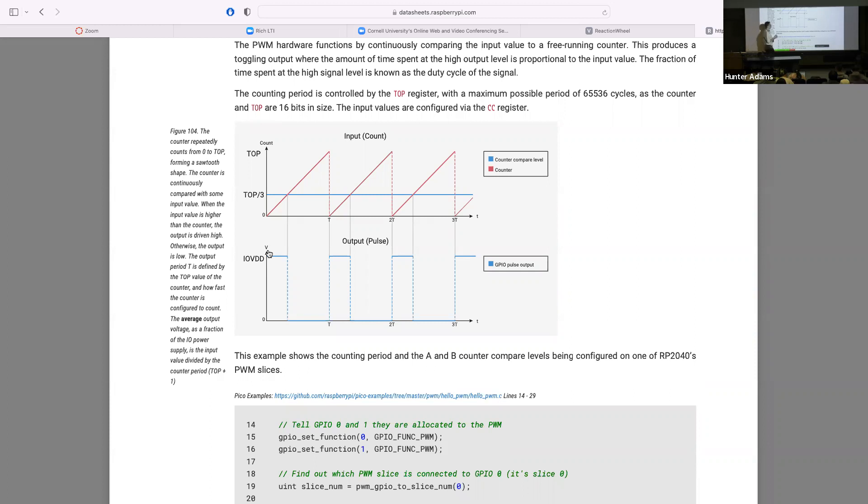Each of these slices has a DMA interface and an interrupt interface. We're going to be using the interrupt interface. In lab three, we're setting up a slice with two outputs for controlling the H-bridge, and every time we complete one period of that PWM output we're going to go into an interrupt service routine, take a measurement off the sensor, compute a control input as a modification of the duty cycle, modify the duty cycle, and wait to do it again. Our PWM signal will run at one kilohertz, so we have plenty of time to get in and out of interrupts.